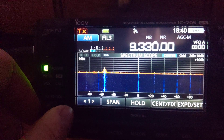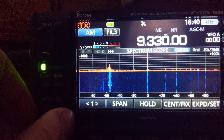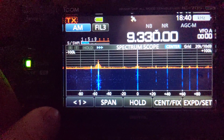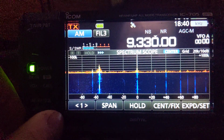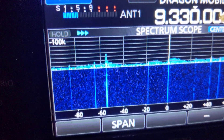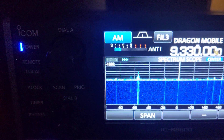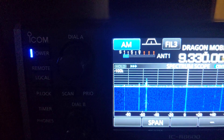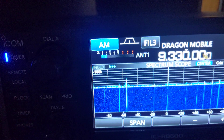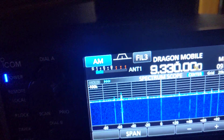One-to-one balun, 35-foot loop. So it's no amplification — it's a little bit more sensitive receiver on this one, I will admit. And the antenna is directional on this. This is a vertical, multiband antenna — it covers roughly 1.5 through to 200 megahertz.